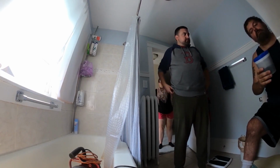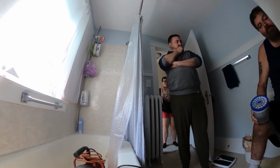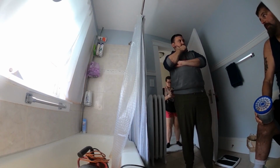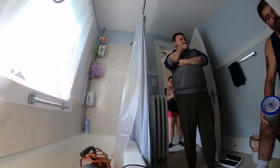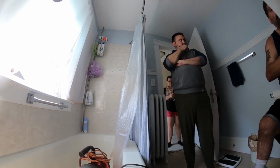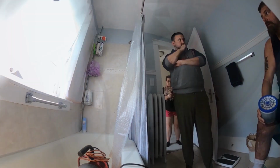So what we have to try and do, and it looks like someone's either tried or got it off, if you can see the nut, is put some pressure on it and take it off. I can't tell if it's an old lead drum trap. They're either made out of copper or basically soft lead, so there is a chance that I could twist it. The only other option is what they call an air gun, and we basically air pressure the line. We block off this one, we inject air into that one, and it blows the blockage through.